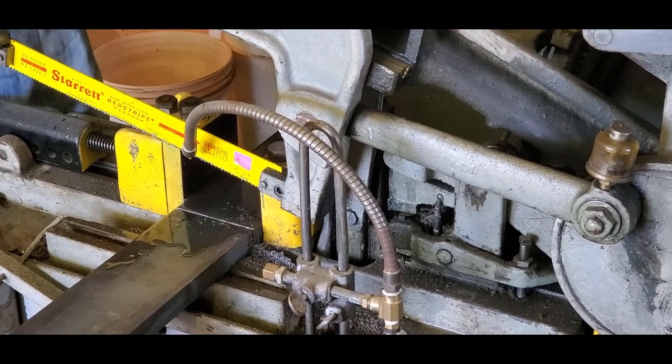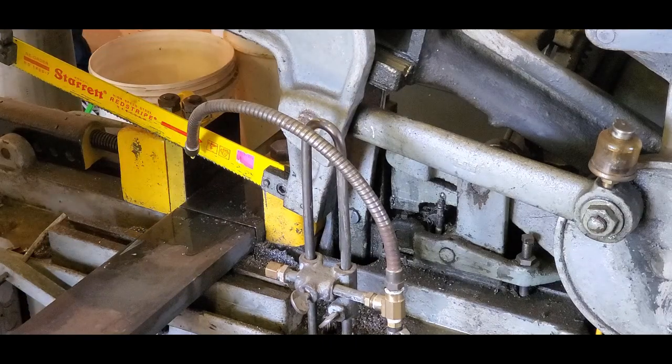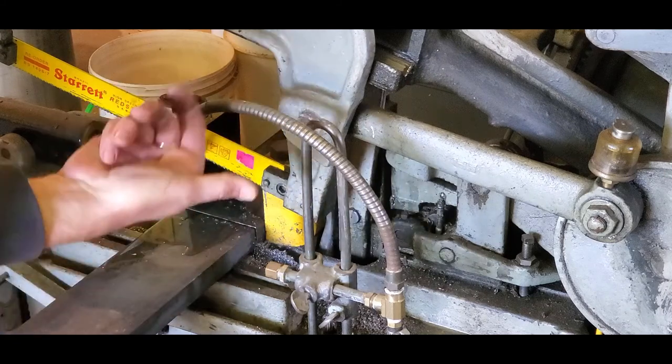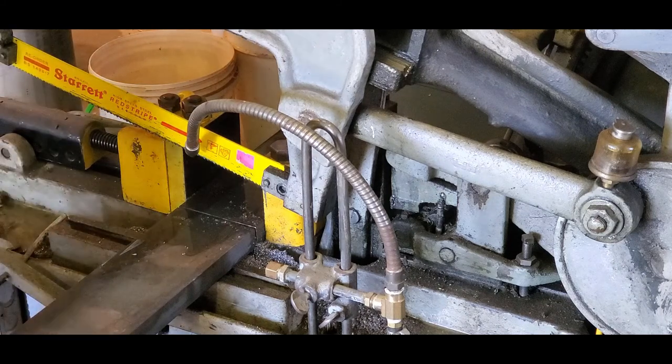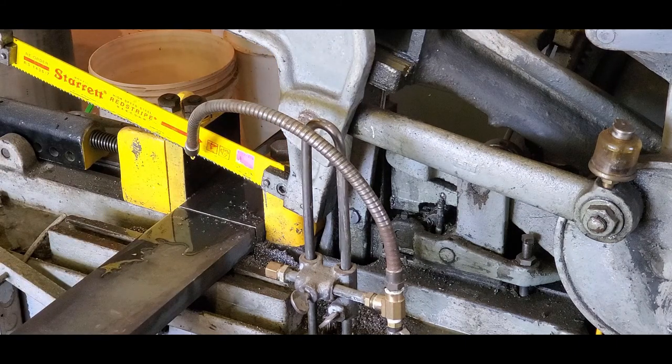Feed rack shifted. Remember how that one mounting foot was broken on the underside? Not really. Yeah, this feed rack bolts to the underside of the bed, and one of the mounting feet, the slot that the screw traps in, was broken. Now I see that it shifted, so the feed poles won't engage squarely.